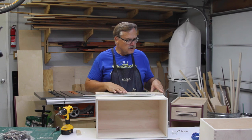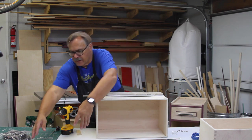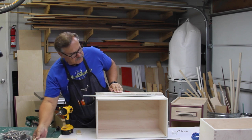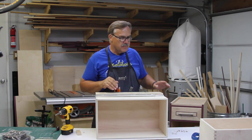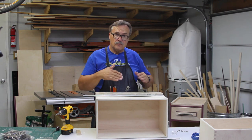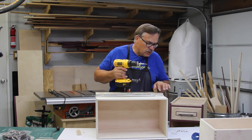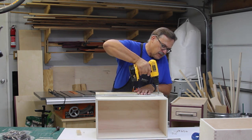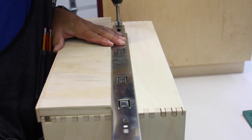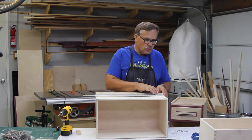The first thing I want to do is get it set at the front. This is an interior drawer that will have a finished piece on the front, so I need to set this drawer at least three-quarters back. All of these drawers are made a half inch smaller than the opening, so I have that much to play with up and down. I'm going to go ahead and screw the inner part into the up-and-down side of the drawer slide.